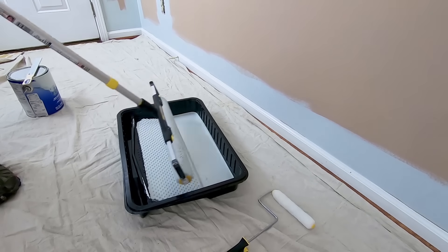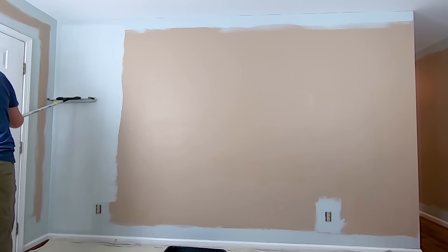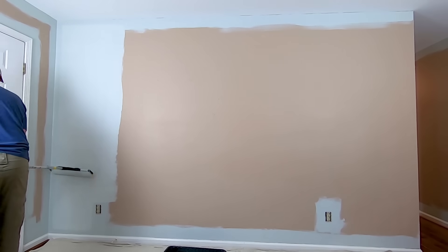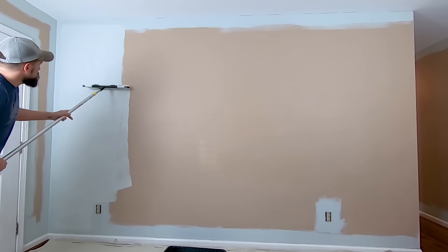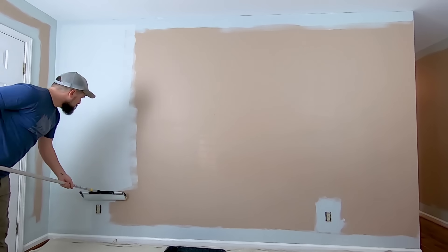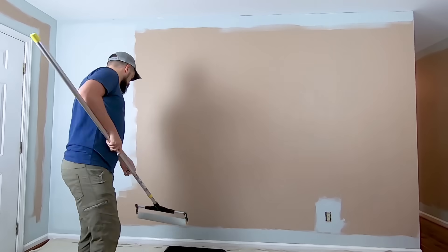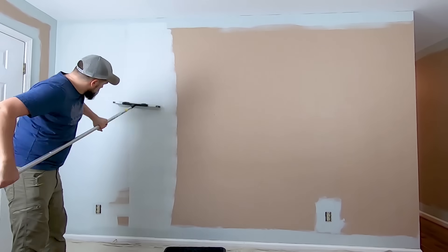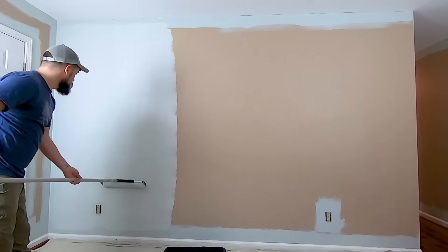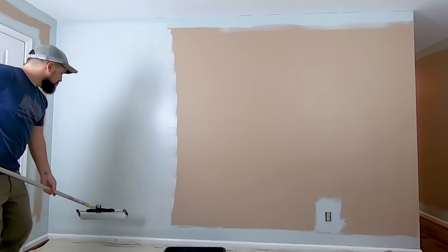On the first coat you'll roll about two full roller widths per paint load, and approximately three widths per paint load on the second coat. If you haven't used an 18-inch roller before, you're in for a treat. While it's twice as big as a standard roller, somehow it paints three times faster. It also eliminates a lot of problems with 9-inch rollers — the 18-inch allows even pressure on both sides, whereas the 9-inch causes users to favor one side, creating roller marks and highs and lows. The standard 9-inch also has a hollow core that can fill with paint, and the method of removing and replacing covers is much more user-friendly on the 18-inch roller.